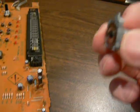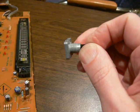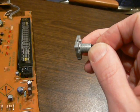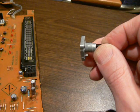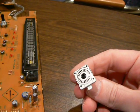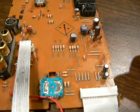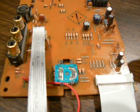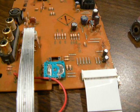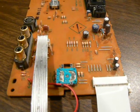There's some kind of sticky grease in here to give the knob some weight so it doesn't spin too easily. I think that grease has migrated onto this wheel and therefore onto these little contacts. So I'm wiping off that grease to hopefully restore a nice original electrical contact.